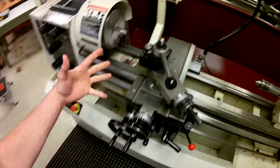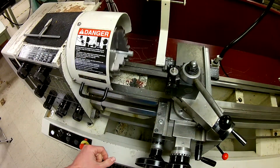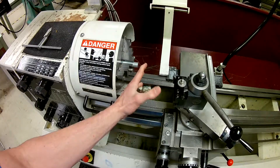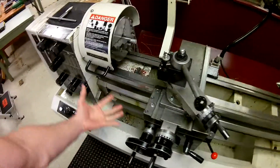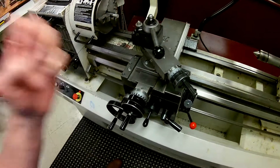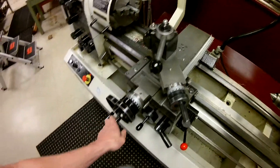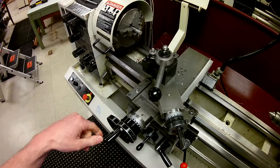The most important takeaway here is that I moved my tool far enough away from the part before starting. If you start with the tool too close to the chuck, you'll end up crashing into it and causing damage. The right approach is to get out of the way first, set everything how you want it, and then experiment safely — so when you pull the levers for real, you won't be in trouble.